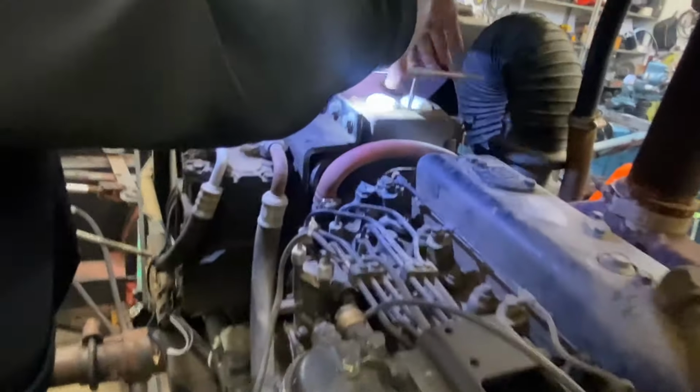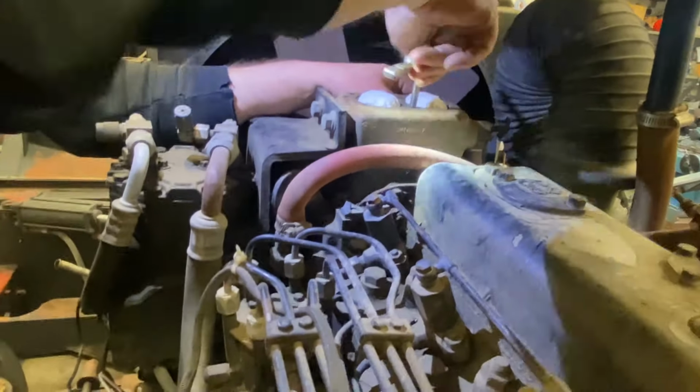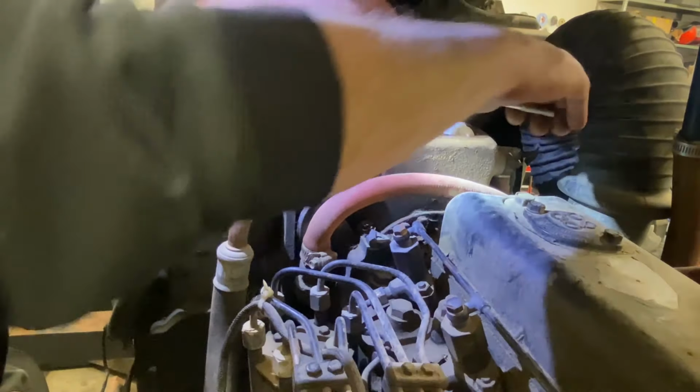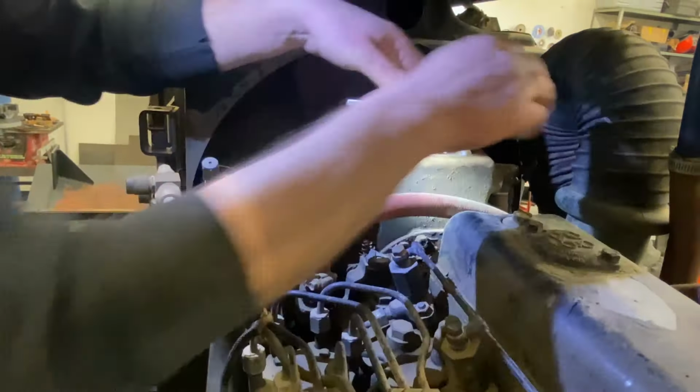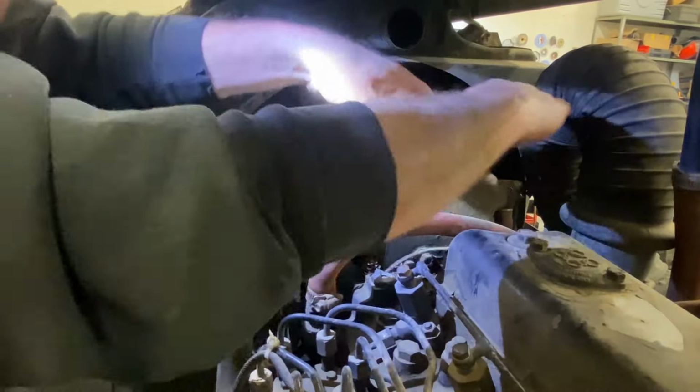All I was saying was that these holes in this casting on the engine are really deep. So even though this is a taper tap I have, which isn't ideal for chasing a blind hole, I'm still getting plenty deep enough in that I think all the threads on the bolt are going to be engaging with clean threads.